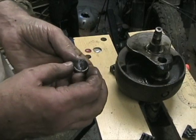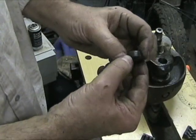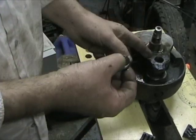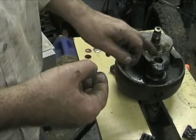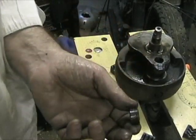Now that came out completely unharmed. The slot is widened a little, but it's perfectly usable. Now you'll hear people say, you've got to drill out that dimple or grind it off, but that won't help. If you think about it, that metal has been deformed. So the threads on their way out are deforming it back to normal.